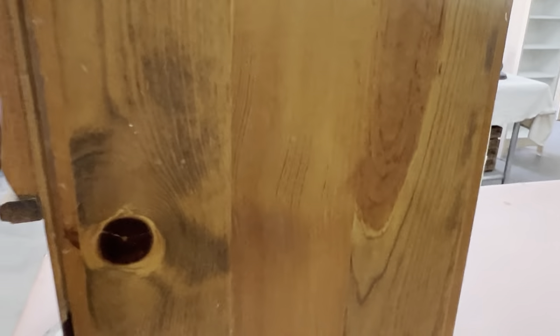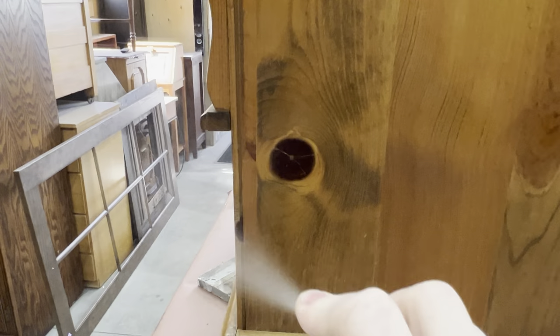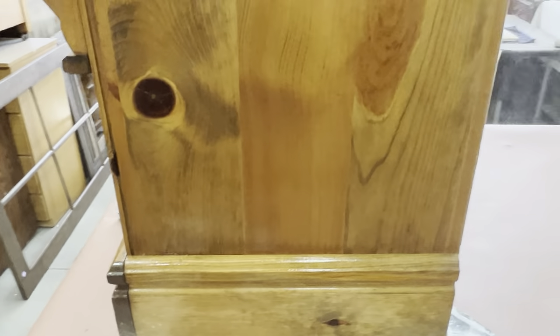So that top, the inside — I want to try to keep a clean line. We've got quite a few knots on this piece and I know it's going to yellow if I paint it white. We're after Memorial Day; we can bring out our whites. So I'm going to go ahead and do a few coats of shellac, especially around those knotted areas that like to bleed through.